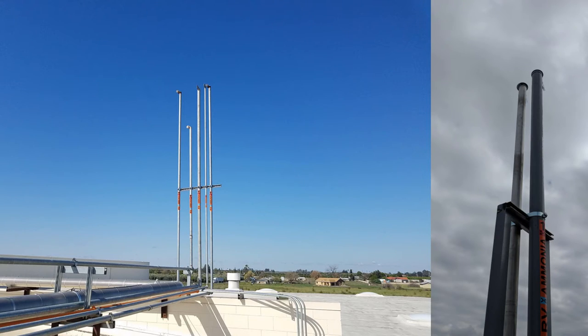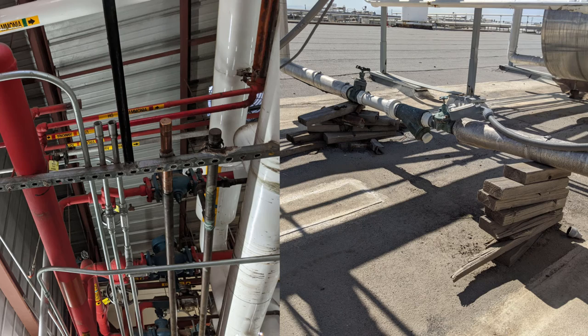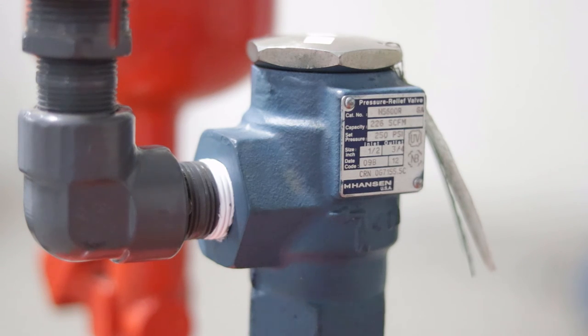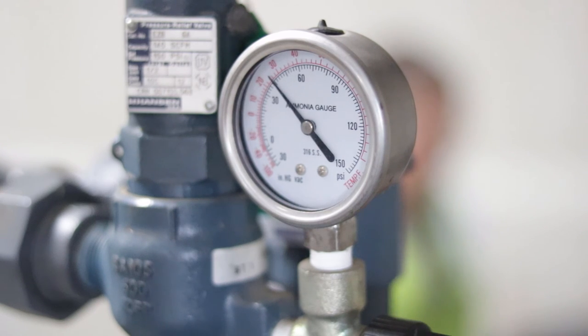Vent the relief valve exit to a safe outdoor location in an approved manner away from people and building openings. Do not install valves in a refrigerated space unless precautions are taken to prevent moisture migration into the valve body or relief vent line. Use brackets or hangers to support the pipe and prevent the valve from being overly stressed. Do not put undue stress on the valve by using it to stretch or line the pipe. Never attempt to reset or change a relief valve set pressure. Relief valves are accurately factory set and do not require any field adjustments. They are intended for one-time overpressure operation and should be replaced immediately after discharging. Always replace relief valves once they have discharged.